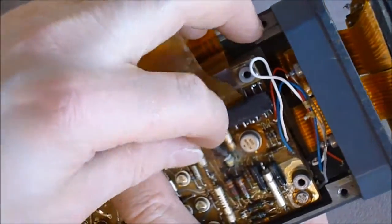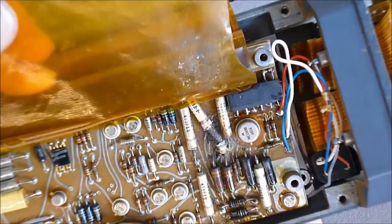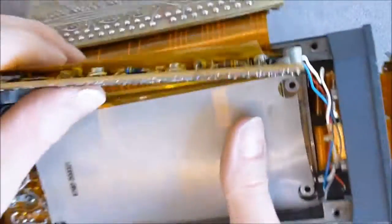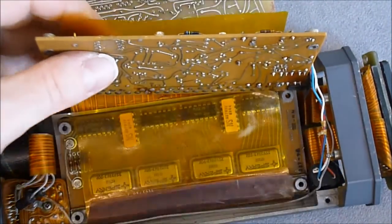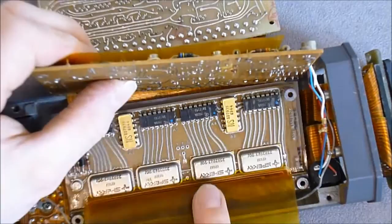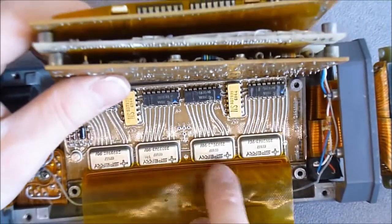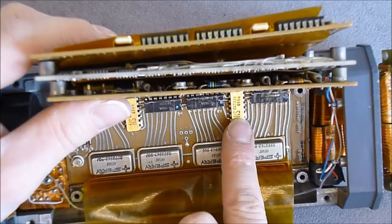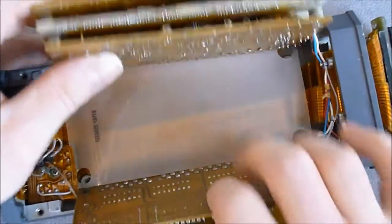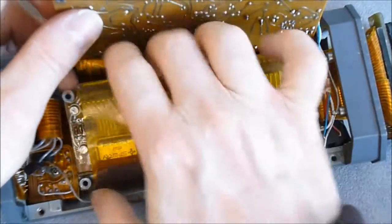Yes, it is in parts — the guts are pulled out of the case. Not something you see every day. That must be why the device was removed from service. Then we have one more layer, which looks quite like the first one. We have four Sperry hybrid circuits, two National Semiconductor chips, still with date codes of 1969, and here is the bottom layer with all the interconnecting flex circuits.